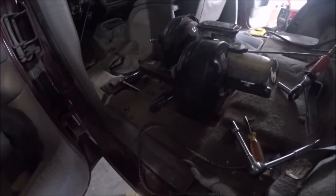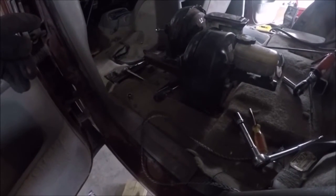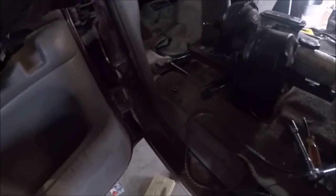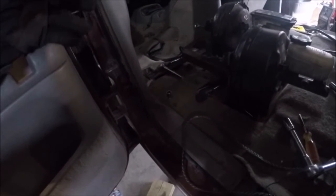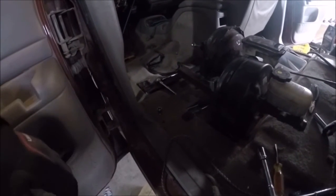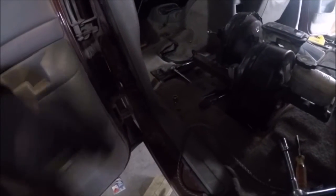And considering that each one of these only runs one brake caliper at a time, not both, hopefully that's enough force. Your leg can put out probably easily four times what your arm can pulling, but the leverage on this is a lot larger. The leverage on the foot pedal is about 3 to 1, maybe a little less, so 2.5 to 1. You can't see it, it's way up underneath how it's designed. So we're doubling the leverage by taking a longer arm. So hopefully that's enough.